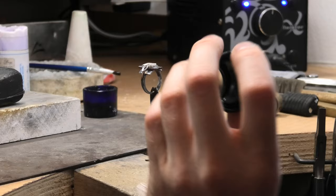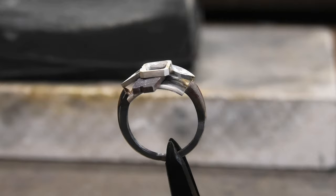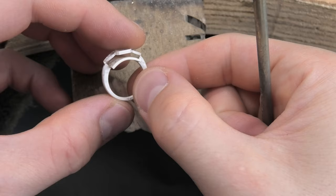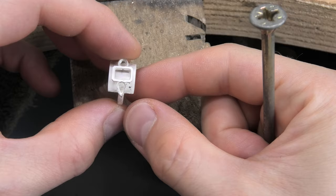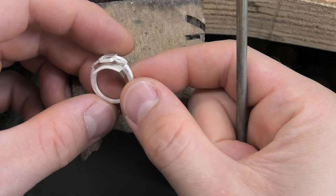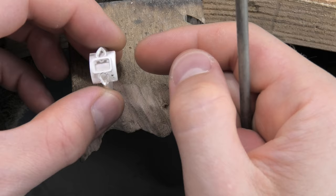Just double-check it's in the correct position — not bad, that's really delicately on there. Look at that — just that little solder there, very delicate. I soldered it, this is fresh out of the acid — just looking over it, making sure it's all straight, making sure my points go right down the center and it's all in a nice straight line. Hold it from the side, check your gaps. Next we've got to cut around that and then file them up together very, very perfectly.